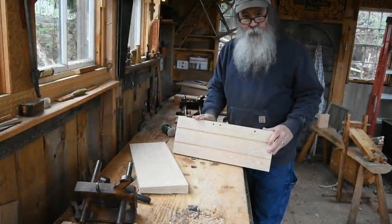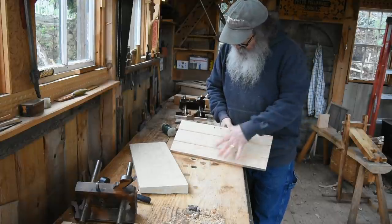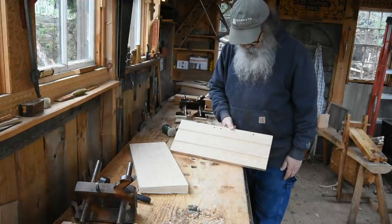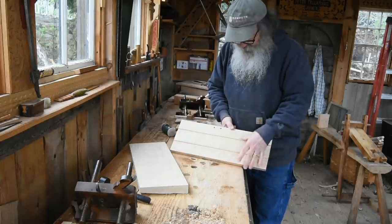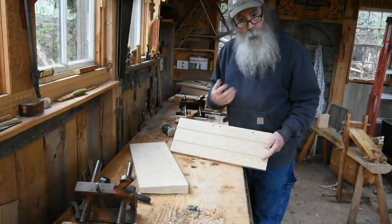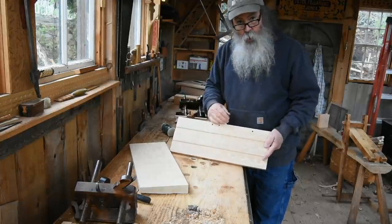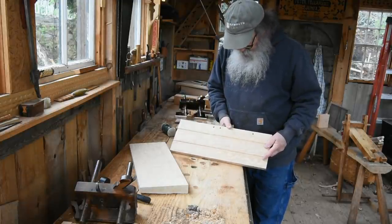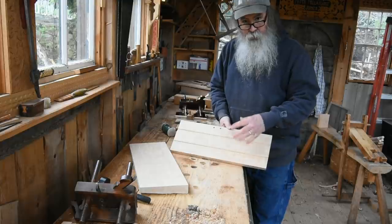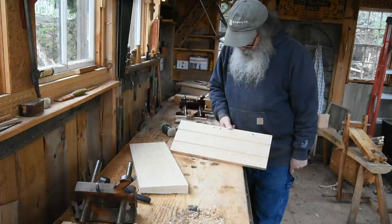The project this afternoon is a couple of pieces for the large cupboard I'm building — horizontal rails in the lower case, in the bottom section of the cupboard. There's one down at the base and one near the top of the lower case, separated by a vertical munt and a couple of panels. They're seven and a half inches tall, a really broad piece of oak, decorated with some moldings cut with a plow plane and a scratch stock. That's what I'm going to show you how to set up and cut now.